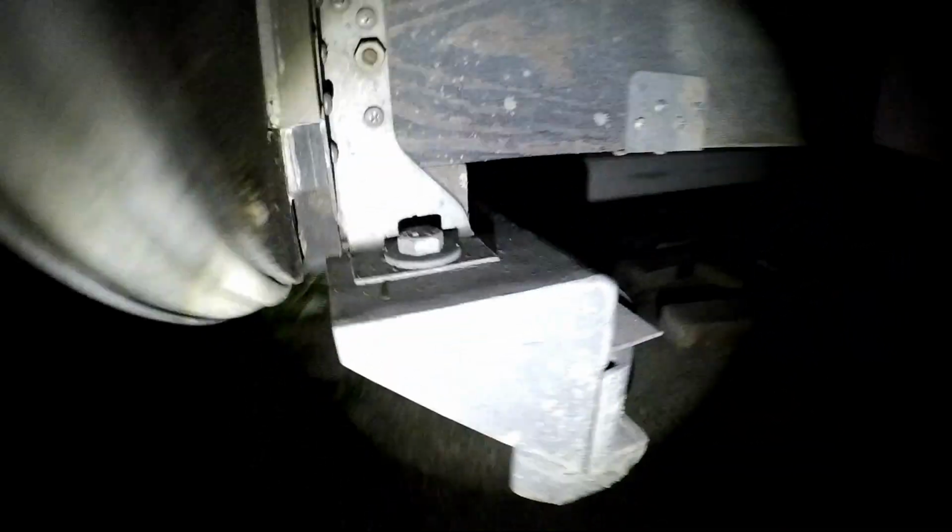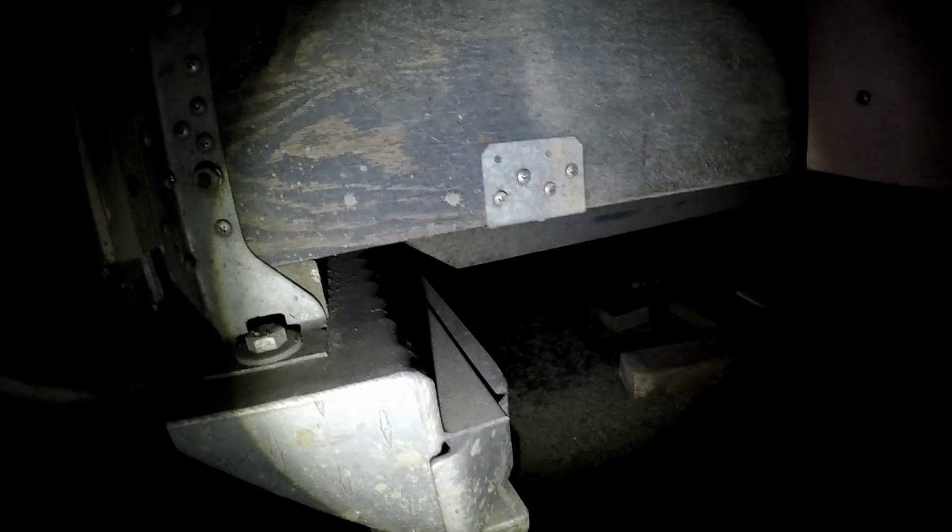And then again over on this side here, you can see that I took the same Simpson heavy-duty bracket, cut it, drilled it, and have a bolt going into it, holding it up, and then it's got 1.5 or 1.25 inch stainless steel screws. And then there's another Simpson A23 bracket, and this is the right side mount bracket, which is pretty much the same as the left. And the arms in back here are 21 inches long.